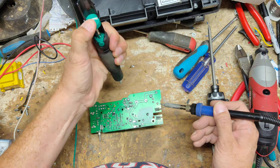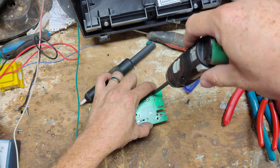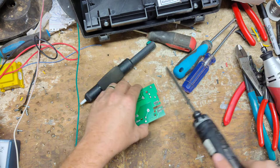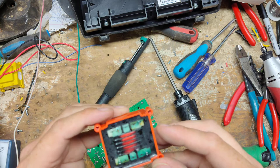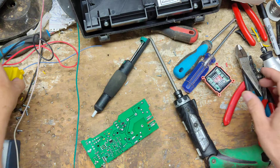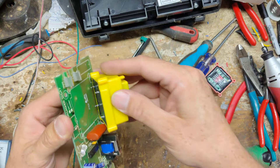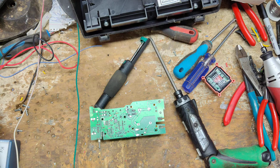We're going to heat up the solder joints and pull the solder off — four solder joints. This version also has screws on the back holding the transformer in place. The transformer looks okay — I don't see any cracks, holes, or burned insulation — but it may be bad internally. I had this replacement transformer close and ready because I was working on another unit for another guy and thought the transformer was the issue there, but it wasn't. So I'll put the old one back on that unit and put the replacement on this one.